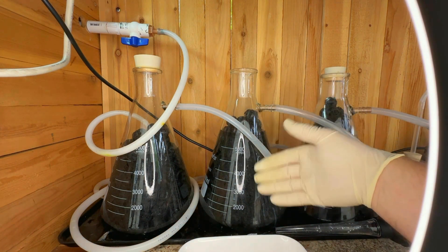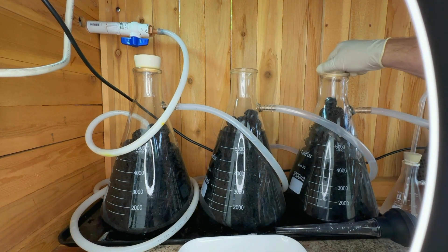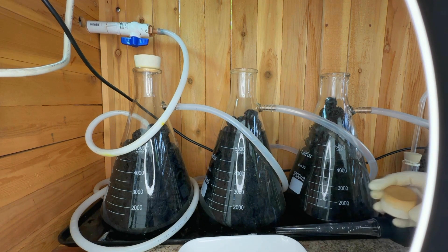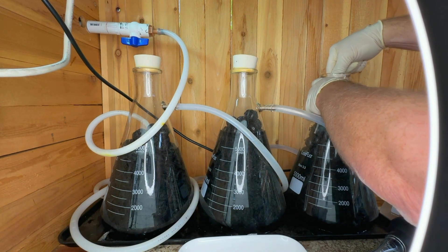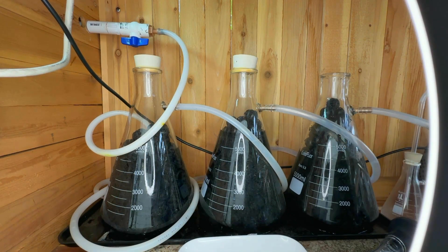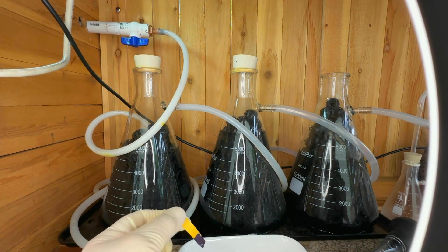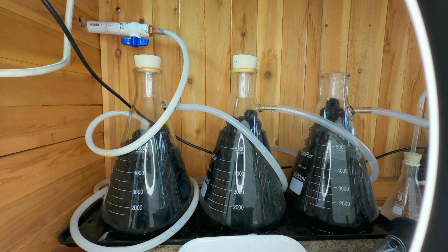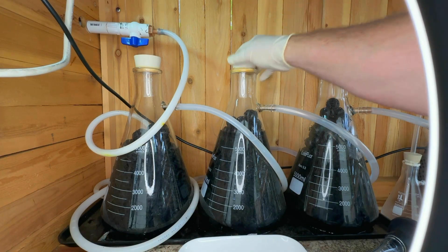Of these last two flasks, the middle one does the bulk of the work, with the third one being really the follow-on in case we lose our ability to neutralize in that middle one. It will almost always stay basic because if we're testing daily, we don't really get a chance for it to get super affected by the NOx before we make adjustments. But we'll check it — as expected, it's basic. I generally go ahead and switch out the fluids at the same time for both of these, just for consistency, to make sure we don't end up feeding NOx out into the atmosphere or into the pump.